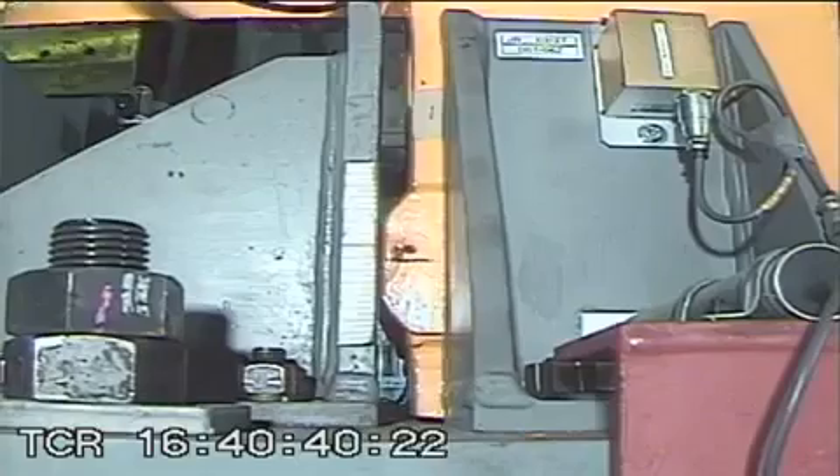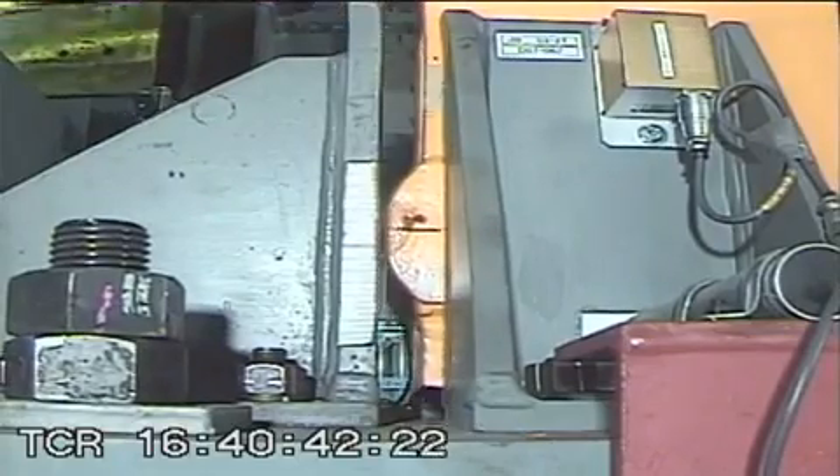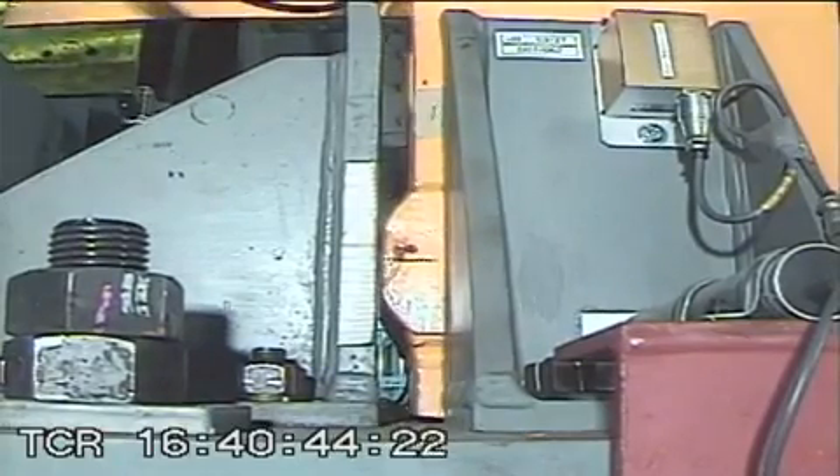The key thing that these frames offer is minimizing the damage, and making the damage that does occur something that was thought about ahead of time, so it's more quickly and economically repairable. The idea is, aside from minimizing the cost of repairs, getting people back into buildings as quickly as possible — avoiding building closures, and when repairs are necessary, getting those done quickly so there's less disruption to the occupants and the broader society.